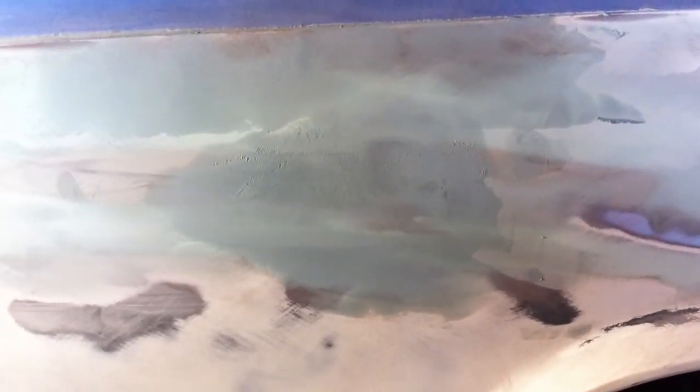Now that doesn't look like much, but that's a good thing, because that's filling in the hole. I think I did much better — I mixed up an appropriate amount, skim coated it in the shallow spot. I could finesse that a little better; I guess it was a little too aggressive feather edging, but getting better.